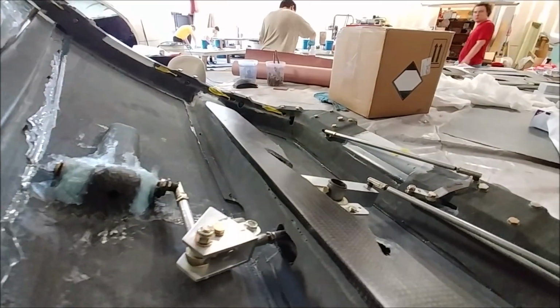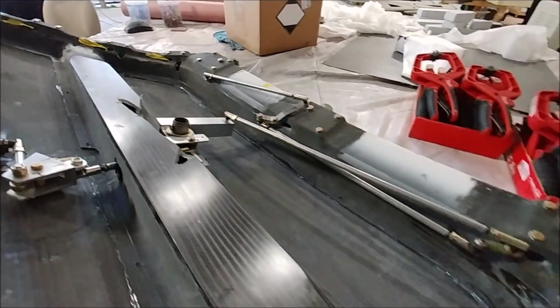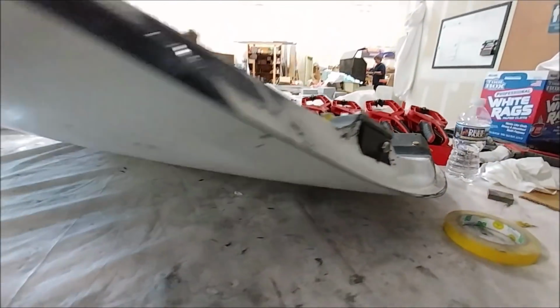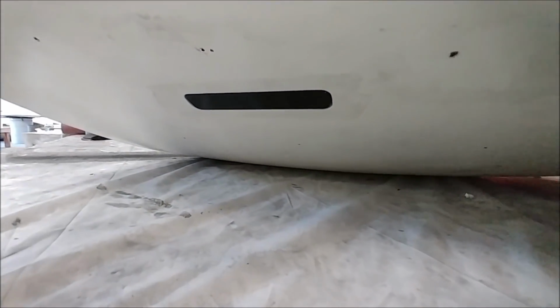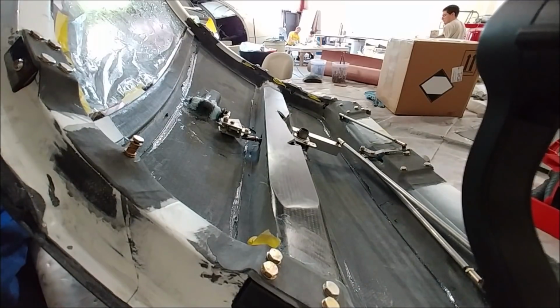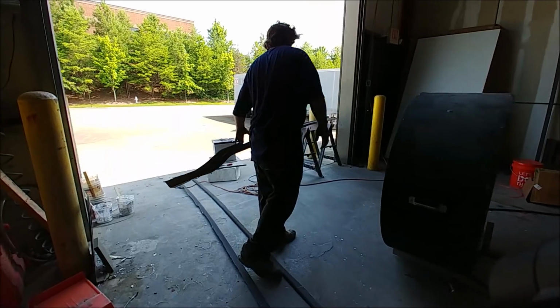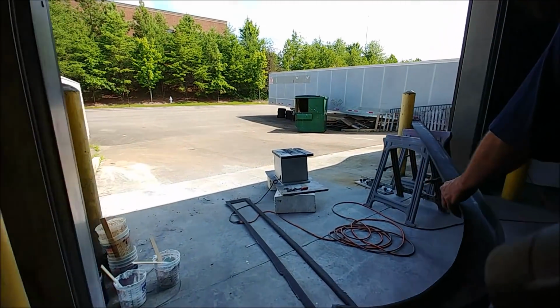So you can see it's sort of linked to the door handle through there, and then another linkage across there, and it seems complicated, and all the other pin locks aren't hooked up right now. But anyway, you basically push on the front of this thing there, and then you can actually grab the inside of it and pull it open. But this is what it looks like when it actuates, and it comes past the over center and unlocks and then goes back the other way. And I'll show a much more detailed one on that later on when I've got it all together with the pin locks and everything.